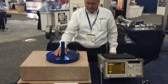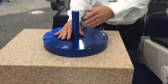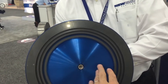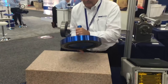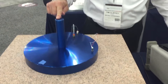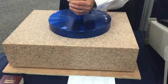Similar to the bellows vacuum-loaded bearing face that you just saw, we have a much larger thrust bearing face here. The outside perimeter is the bearing face and everything on the inside has vacuum pressure applied to it. Go ahead and set it down, Tim. You'll see that it's floating frictionlessly on just the air film. But when he turns the vacuum pressure on, you get about a ton of force pushing this blue bearing down onto the granite table.